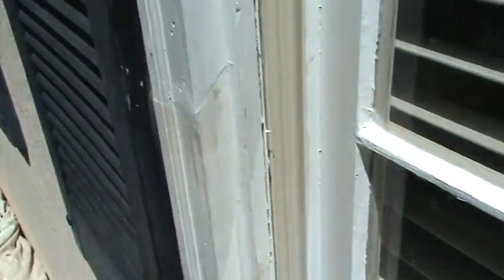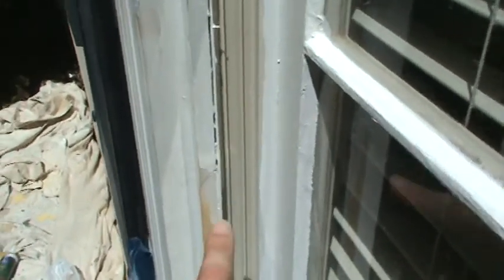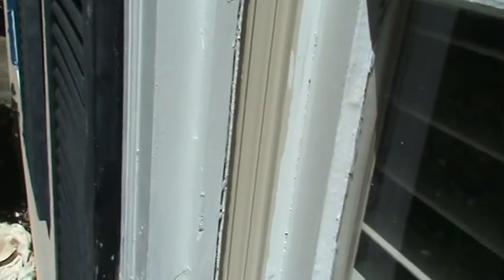We left it a little unfinished in the front so you can see the difference. If it were left like this — like a lot of contractors in Atlanta do — it's just going to rot both pieces. The trim piece down here has been pieced in, and this whole piece has been primed on all six faces, including the edge behind here and the lower edge. So it's never going to rot out again. We're using premium materials. The guys haven't come through yet because this will be primed with oil-based primer. We wanted to leave that one raw to show you guys the repair. We get a lot of questions about exactly how we're making these cuts. See the angle here — how it sheds to the front? Any moisture that might get behind here is going to shed out to the front. This will be caulked and sealed as well. See how smooth that cut is? It fits really well, and once it's painted over with a coat of good paint — we use Sherwin-Williams Duration, one of the best paints in the country, along with Emerald — it'll look great.